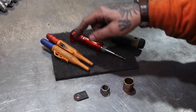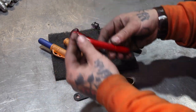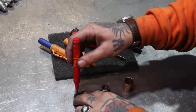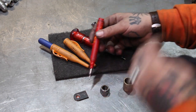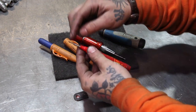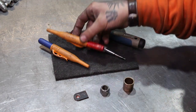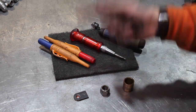These markers I get a lot of questions about. They're Pica brand — P-I-C-A — and it's their deep hole marker. Fantastic markers for anything steel, I'm sure they work fine on wood too. The cool thing is this design with the very slim tapered front that you can get in and do hole positions. If you're ever working on a cover that you need to figure out the hole pattern to either remake it or make a part to fit, these are killer. The tips are also flippable — you can pull the felt out, turn it around, and you get a lot of life out of them. They're a little bit more expensive than a Sharpie but for the extra time you get out of them, way better.